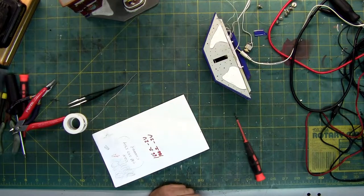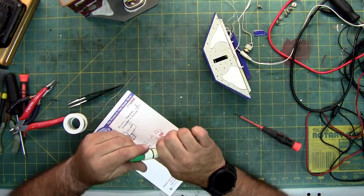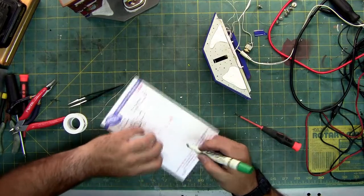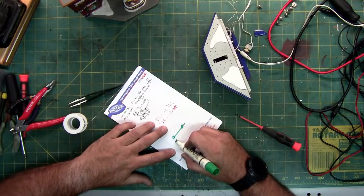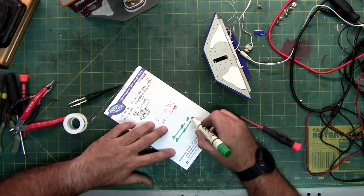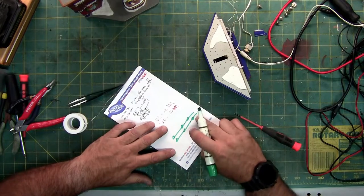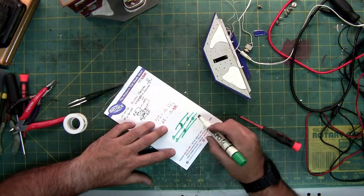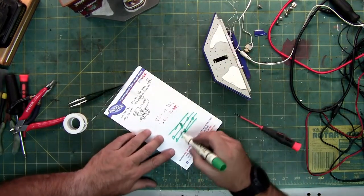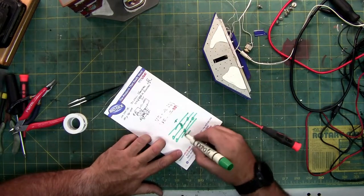Show you what I was dealing with, since I can't show you in the sense that I can't bring it up. So I have a LED and LED, and what they did is they soldered all these together. So here's the green, red, yellow. They're all soldered in a line, and in groups of three. And in this solder ball right here is one wire, and in this solder ball right here is another. So we got the positive that goes all the way around this marquee that every third solder joint is connected. And then we have the negative on the bottom.